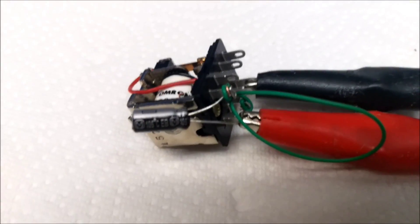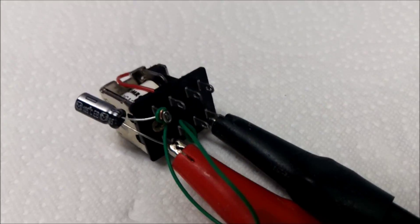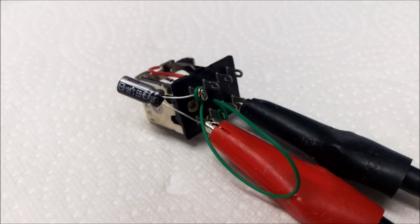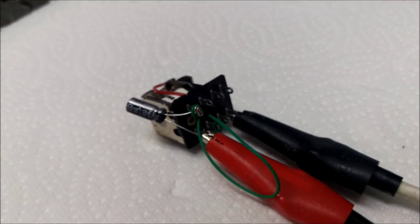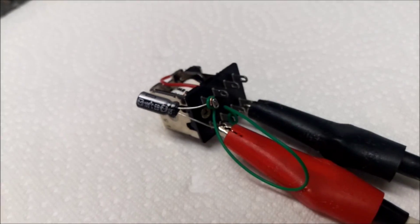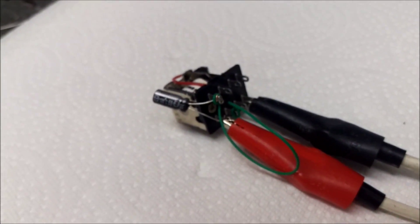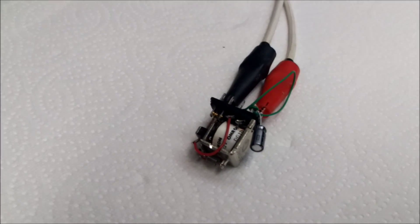What I've done is wired a 10 microfarad capacitor across the coil, with the terminals wrapped around the coil terminals. I don't solder them because if you do, the relay probably won't seat itself back in the socket. I've got a jumper wire jumping one coil terminal over to the normally closed contact, with the positive lead on the coil and the negative through the normally closed contact. When I energize it, the coil will draw the relay open, cutting power to the coil. The capacitor discharges through the coil giving it some hang time, and it will basically oscillate and cycle the contacts between their two states.